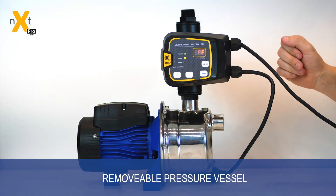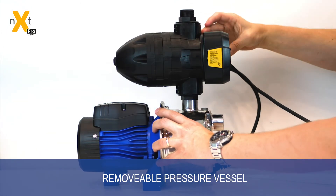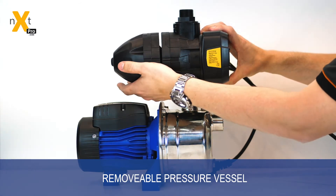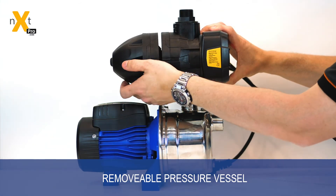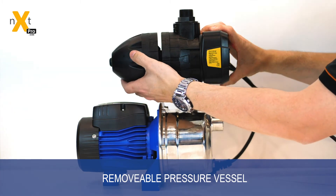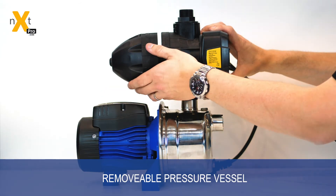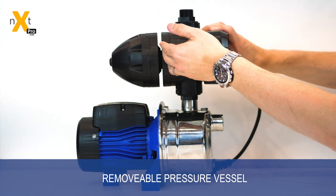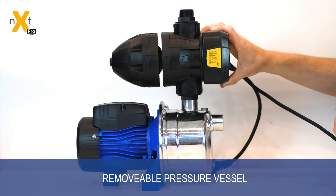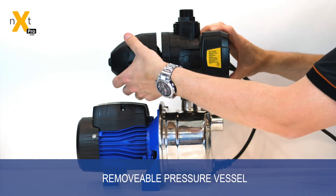One other hydraulic feature to be aware of is that on the pro version, the pressure vessel on the back is removable. If you remove the pressure vessel, you're then able to connect through a one-inch BSP fitting any other size pressure vessel you might require. For example, you might design to use it on a horizontal tank, either connected directly into the back of the device itself or even mounting the controller on the tank itself. Very straightforward, very simple to use and very easy to remove.